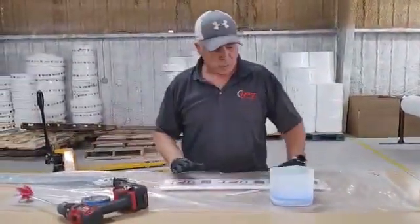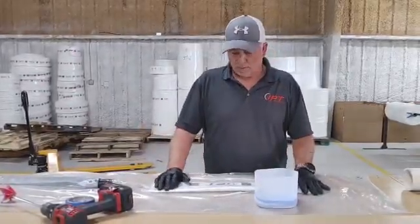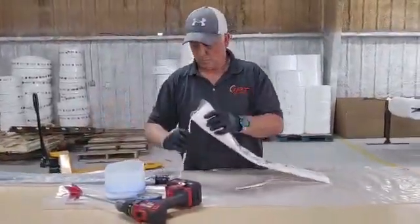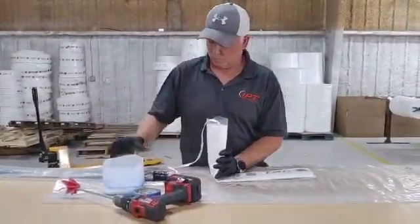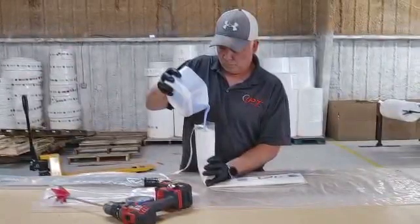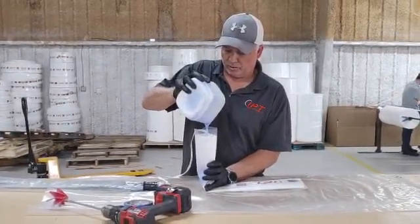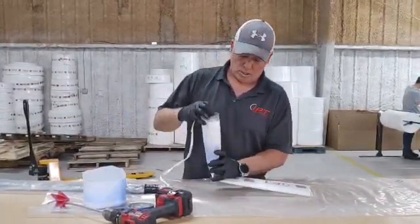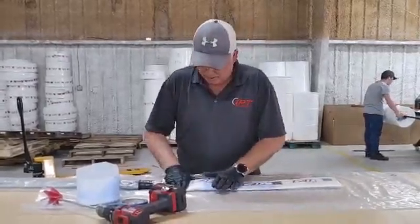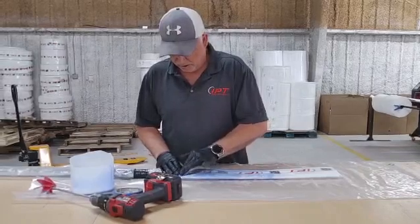What's nice about this system is when I pour this in, you're going to see the simple wet out. We can design and develop small hand wet-out rollers that force this epoxy into place. We simply pour our pre-measured mix into the liner, then pull our wet-out sleeve a little further out of that liner and wet it out. You'll see no epoxy coming out of the liner whatsoever — everything is completely encapsulated.